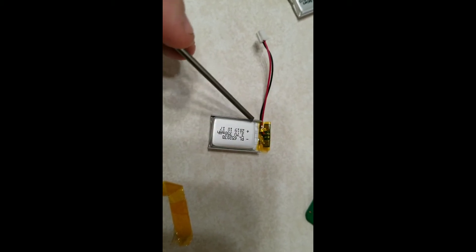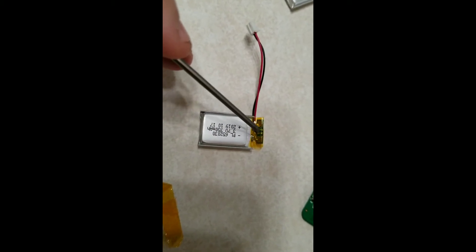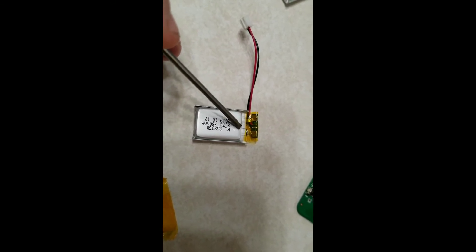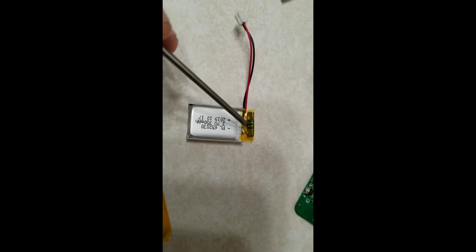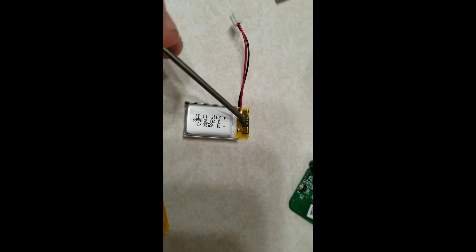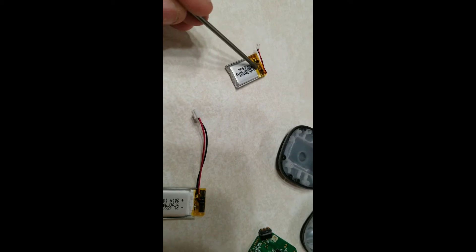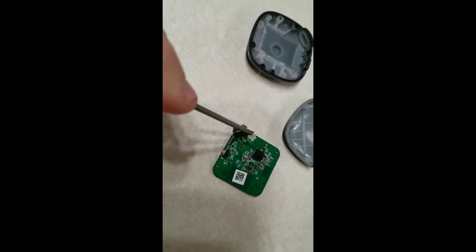I removed the Kapton tape — this is what they call Kapton tape. I cut it along the side and unpeeled it, and then you can see where the little charge regulation board was folded down here. I just folded it over and I can now see where the two wires are soldered on the back side of that board for the connector. I need to remove this wire from this battery at the same point and then solder it on there, so I can end up with this connector which connects to the board.